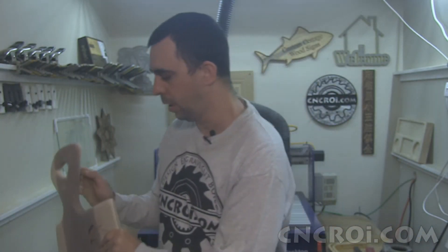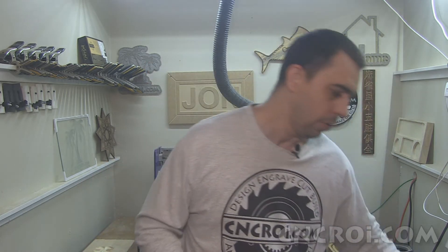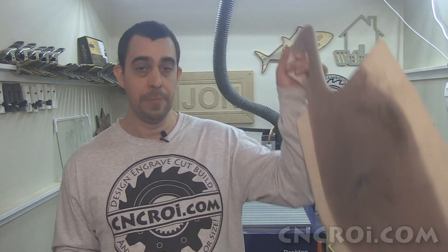You've seen me do a lot of custom laser work in the shop here, and you might be wondering why would I use our CNC router — even our small CNC router instead of our large CNC router — and why would I use that over a laser? The most direct answer to that is control. With our laser, there's no two-way feedback system, meaning that I can't say go a quarter inch deep and the laser will go a quarter inch deep. The laser will just engrave, and that's basically what you get. You can pass over it many, many times, and that's how you get your depth inside of wood. But again, there's no two-way feedback system.